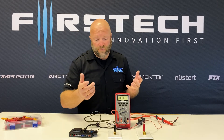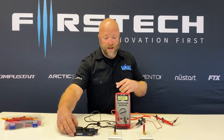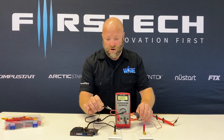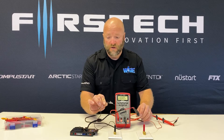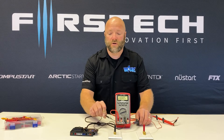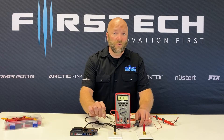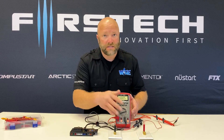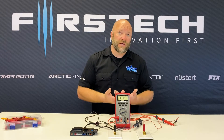On the bench here in front of me, I have a new CMX brain along with a Blade AL. I have my multimeter set up and the unit itself is grounded — I have ground connected to the ground wire of the unit itself. Just for demonstration purposes, I'm going to meter just the brain alone, and then I'm going to slide that blade in and take a meter reading for both the blade and the brain. You'll notice where I have my leads is different than where I would have them if I was metering for DC or AC voltage.